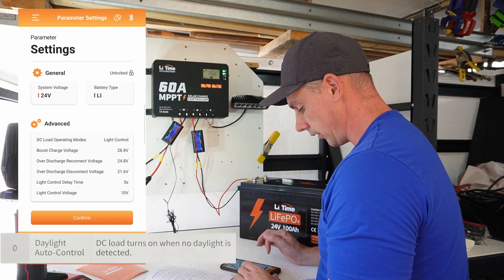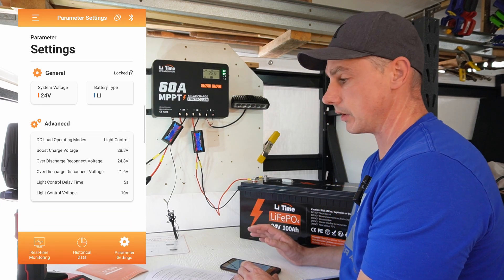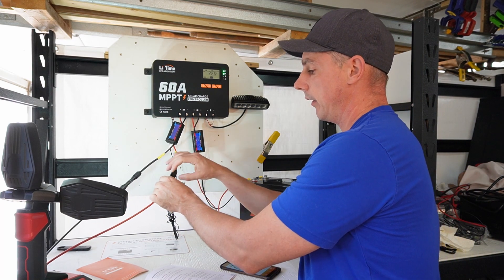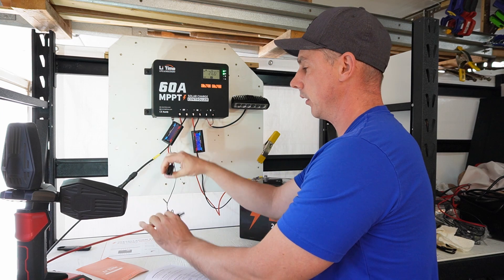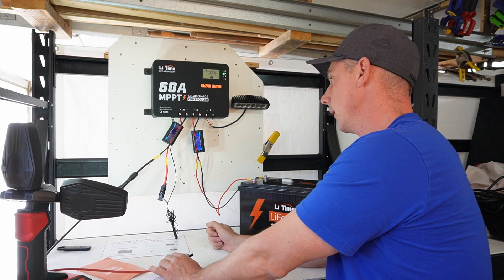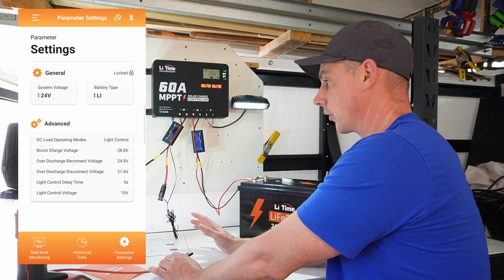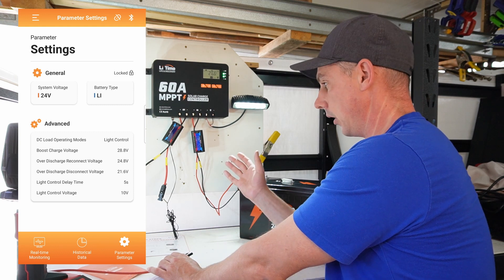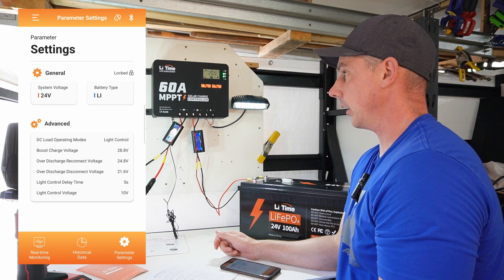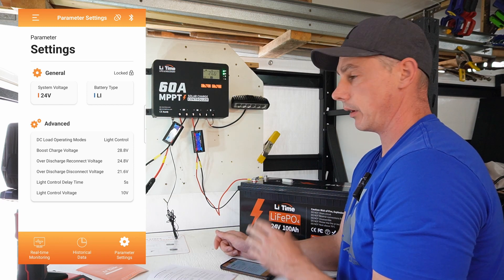What light control mode does is: if there's no sun power detected, the light will turn on. So if I disconnect the solar, in five seconds that light is going to turn on. You can see — when there's no solar, the light comes on. And then when there is solar again, we wait for the MPPT to track it, and the light goes off.